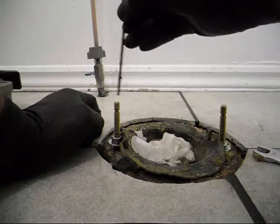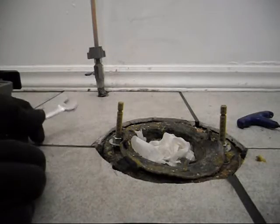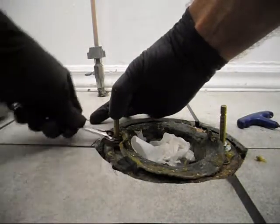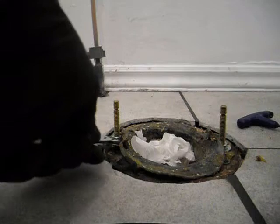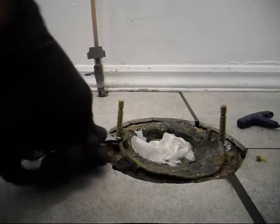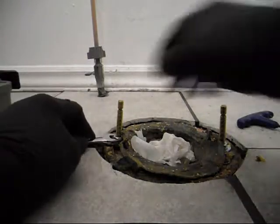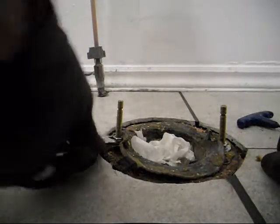I've got a line across the top right there. I'm looking at my line to make sure it's going across so that my slotted bolt, which is centered, the slot doesn't always coincide with the center depending how they turn the ring. The slot may not end. I always end my slot real close so that as much strength as possible in this flange, this floor flange. Because sometimes they're not very thick. I'm going to move it towards the camera a little bit. Like that. Make sure my alignment, pencil mark.